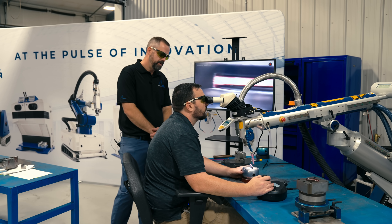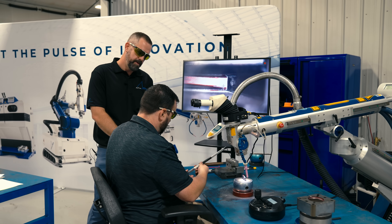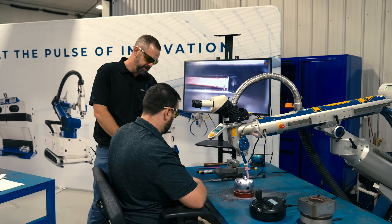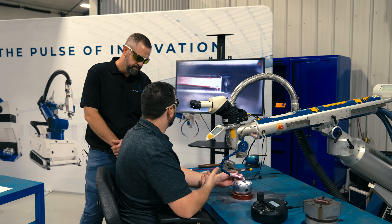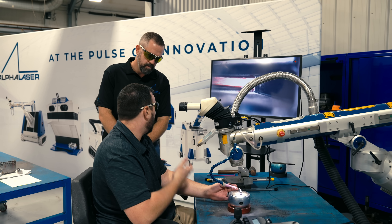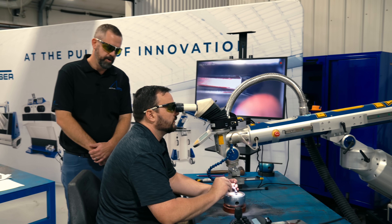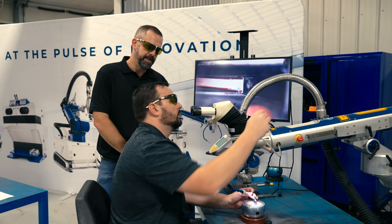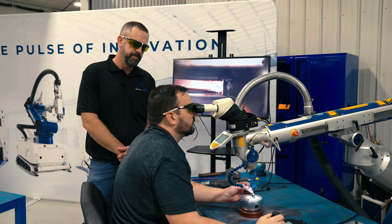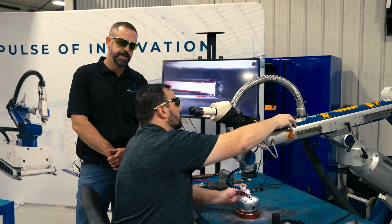So what material is this cavity, Mike? This cavity is made out of P20, so I'm going to use P20 modified on it. P20 modified is a little softer, but because of the air quenching of the laser, I'm actually able to achieve a little bit harder than conventional P20 — just because of the process of using a laser. So another advantage of laser welding is you can weld dissimilar metals. You don't have to use the exact same filler material for what you're welding, depending on the material of course. You're able to weld different steels together.